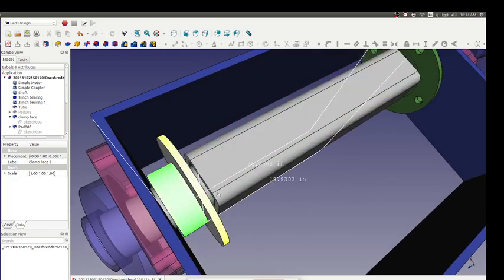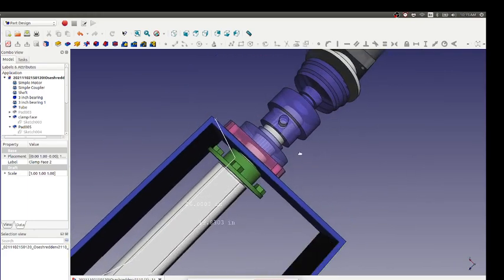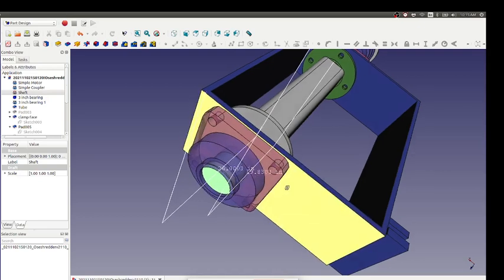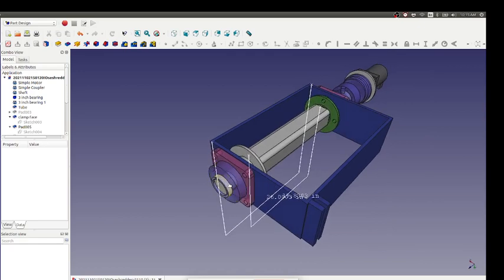Going around the shaft is easier to make but less flexible; the around-square-shaft option has more utility — you can vary the overall zone of blades, which is a convenient feature. Looking at whether things are fitting well: the shaft goes all the way and the bearing should be pretty much within an eighth of the actual height of the bearing, which is good. One thing we haven't addressed: how do you fix the shaft within the bearings? We'd need a set screw or collar. We have two types of bearings — one has eccentric collars that lock onto the shaft, another style has just a set screw.